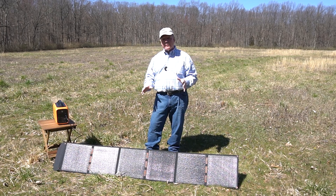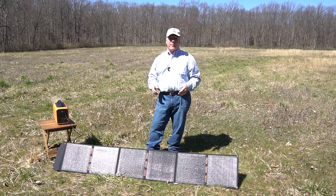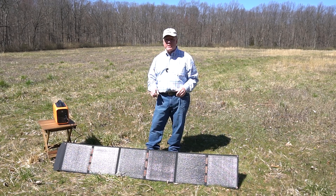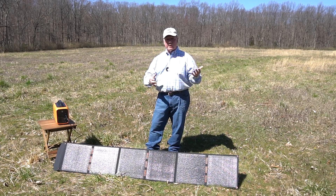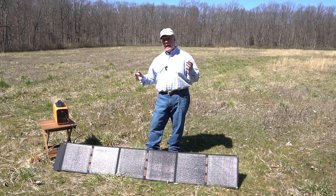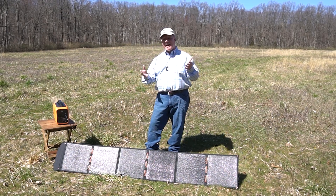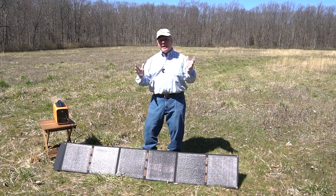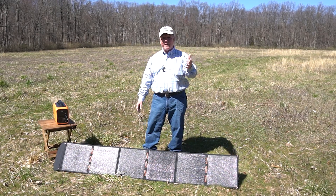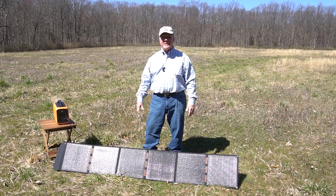I think it's a wonderful product. The benefits: it's small, portable, and lightweight. It uses monocrystalline panels — the best you can get — at 23% efficiency. It outputs 18 volts at 5.5 amps, which is perfect for all portable power stations on the market, and it has an IP65 water rating. You've got everything you want in this unit and I just like it an awful lot. Thanks for watching — I hope you found this helpful. I love talking about this kind of technology, and until next time, stay nerdy.